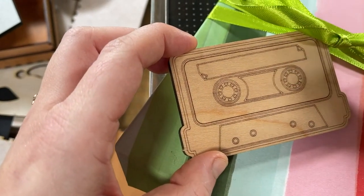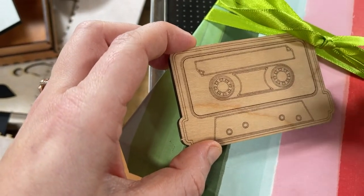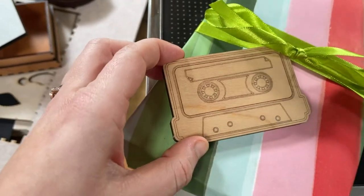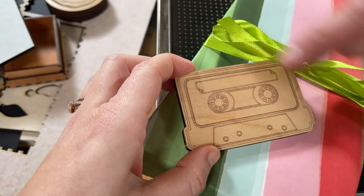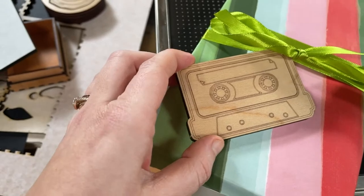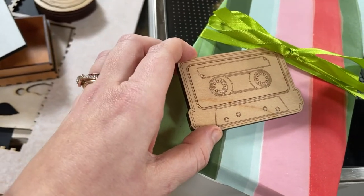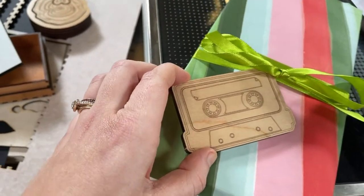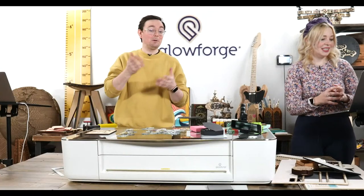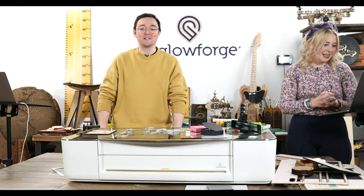And if you think about the engrave settings, it's going anywhere between sort of 195 to 340 times per inch. So that's a lot of passes. That print's going to take a little while. A score, it's just going to go zip, zip, zip, zip. It's not quite the noise it makes, but similar, and it will produce a very similar effect. So it's great for designs like this. It's great if you want to cut through the masking paper and create stencils for applying paint effects, things like that. Great if you want paper to fold. So you are not wrong in thinking that it's a light engrave. It's just a slightly different function, if you like, with the printer.